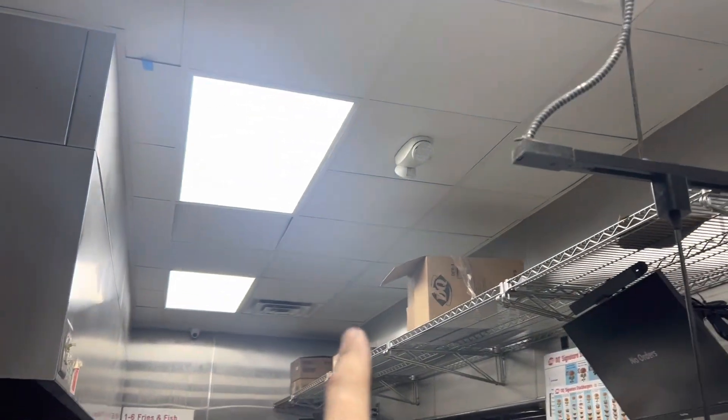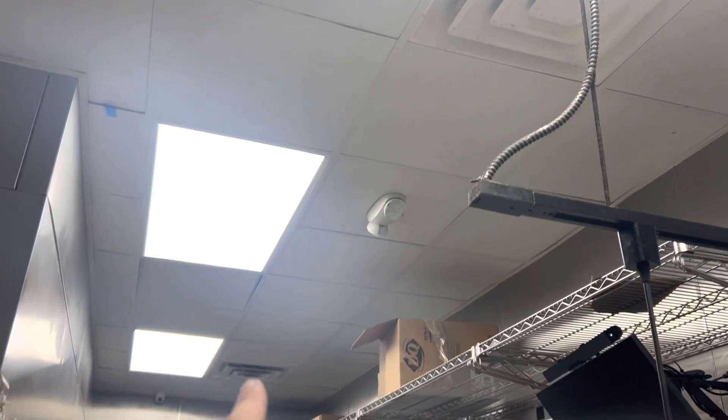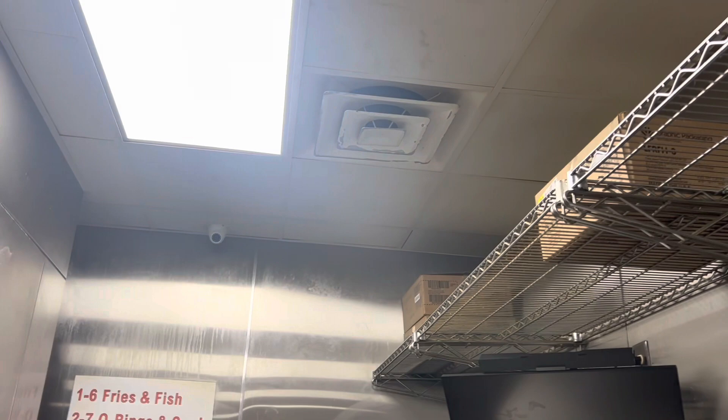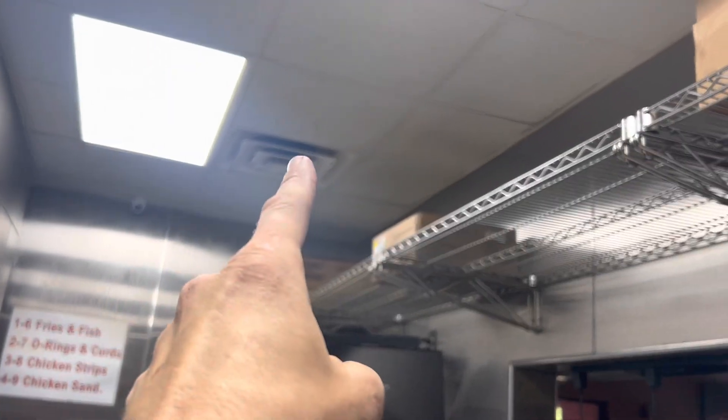Because I'm assuming you saw the first video, but maybe not — maybe you just found me. So here's what happened: the thermostat is here in this kitchen, it controls the unit right here, and it does all the ductwork back here in this prep area and all the ductwork into this ice cream area, but it did not do these two. It was supposed to, but when they put the trunk in here they ran the trunk and they didn't cut out into the box. So I'm imagining when the actual skilled person showed up to hang the registers and went 'how come I don't have air in the trunk?' — they tied the two ducts into the unit in the hallway. That register is flexed here to the trunk that runs and is tied in there, and then my box is right here. In this unit I put a takeoff there, and this unit is just flexed right there — so that's done.